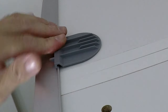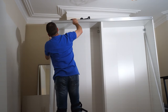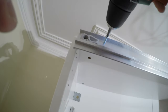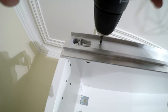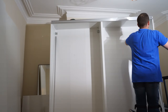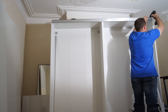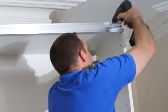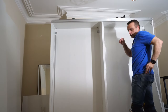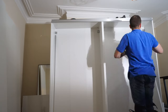Secure the first plastic on top just to stop the rail from falling on your head while you're fixing the front screws - no need to fully tighten the screw, it's just holding the rail in place. Now put the long screws in from the front. There are no pre-drilled holes here, so just place the rail as it's supposed to be, equally divided on each side, and place one long screw on each side to hold the frame from the front.